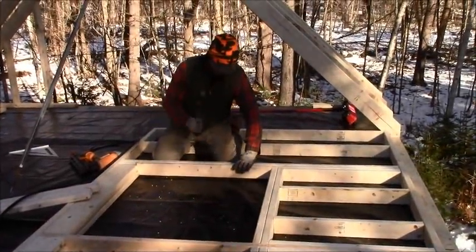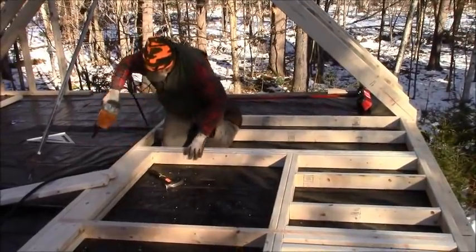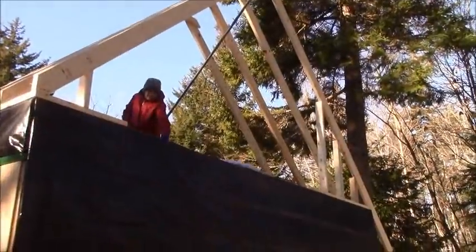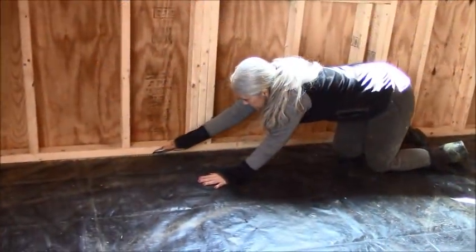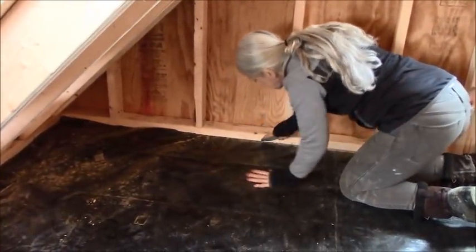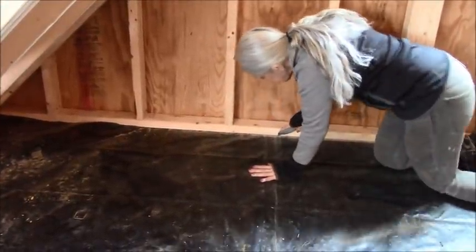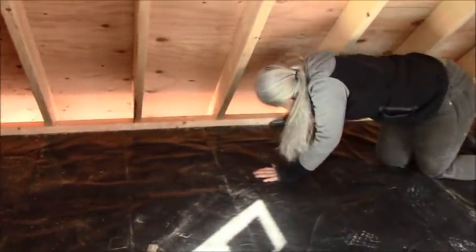As soon as we got the floor system for the second story in place, we covered it with a tarp and nailed a 2x4 plate around the perimeter on three sides. By doing only three sides, it prevented rain from pooling up and gave us an outlet to sweep out the snow and ice. This was a small investment to protect a larger one. Now that the structure is dried in, we'll cut the tarp away and reuse it as a vapor barrier between the top of the gravel and the finished floor of the garage. And it's already cut to size. This is a win-win situation, and you know how I feel about those.